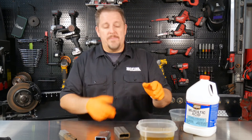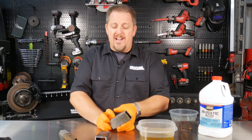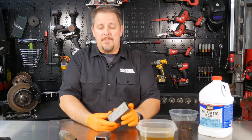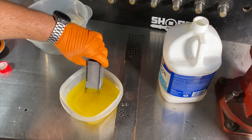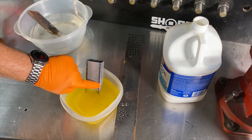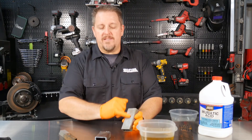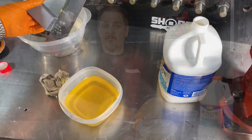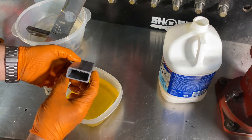Don't assume that the toxicity or the acid has actually calmed down, because it's still working. As you can see here after a few minutes, it's eaten all the mill scale off, it's eaten all the rust off. This is ready for a quick scuff and a paint. I mean, if you wanted to hit this with 220, or if you just want to hit it with paint already — you see some grinding marks from when I first tried to grind that mill scale off — but otherwise really clean metal.